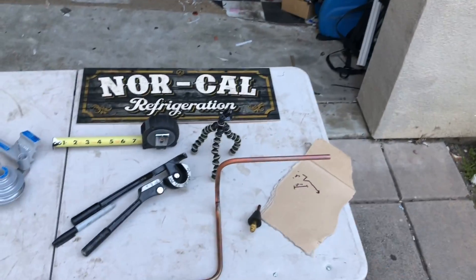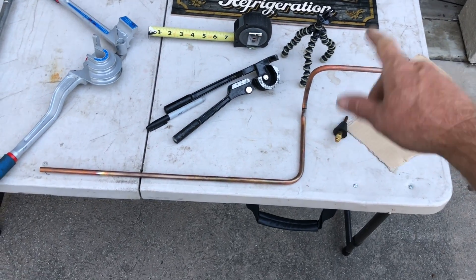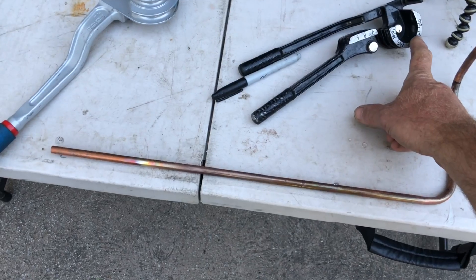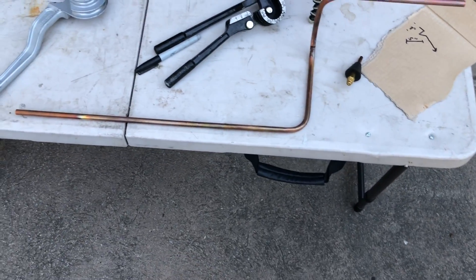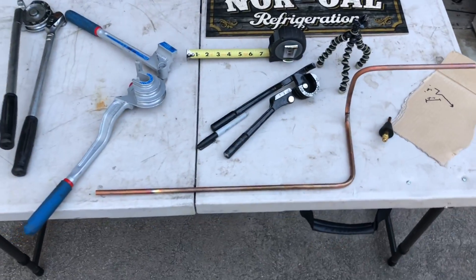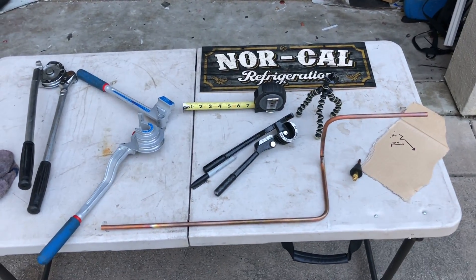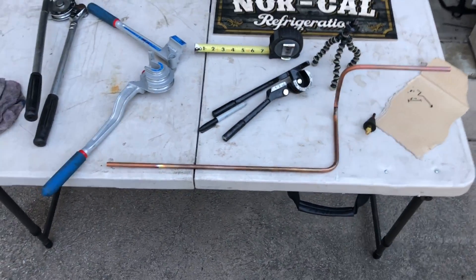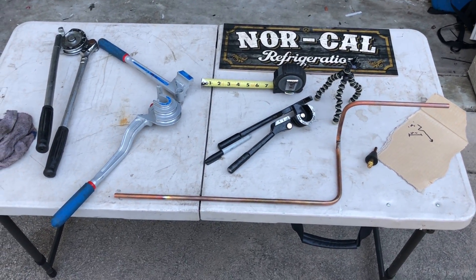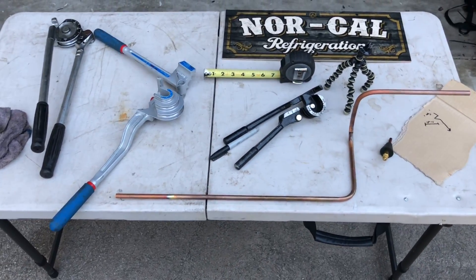So the main trick and tip is you've got to anneal the hard pipe. You want to measure, get your first bend, measure from the back of your 90, make sure your mark is lined up on the 45 of the heel of the bender, and measure from the back of the 90 to the next mark. That's how I do it. I hope this has been helpful. You guys that bend pipe more than me or know more about it, please leave a comment below and we'll help out any of the new guys. Like, subscribe, and we'll see you on the next one.